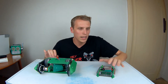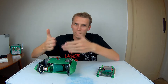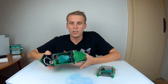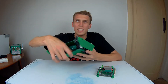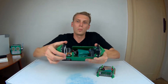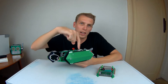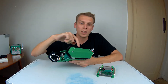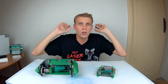That's about it for Don't Need Roads — it also had the electronics re-soldered inside to make everything sit nicely. For Not Again, you guys were talking about the front sections splaying outwards in the last fight video, so to combat that there is a 3/16th inch bolt that runs from one side to the other with nylocks on either end, which means those parts now cannot move — they're rigidly locked. Then on the wheels themselves there are now heat insert nuts, which means I can lock the wheels onto the motor shafts better, because that was the other main issue last time.